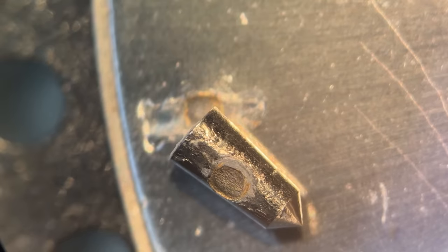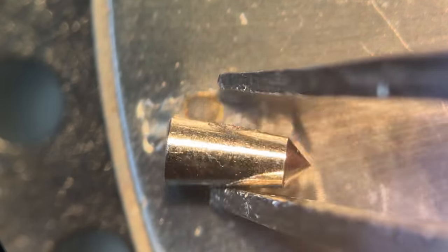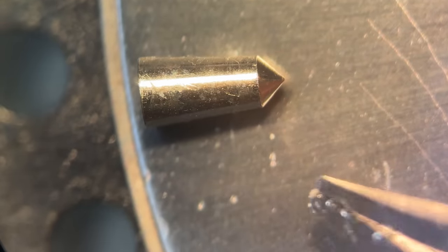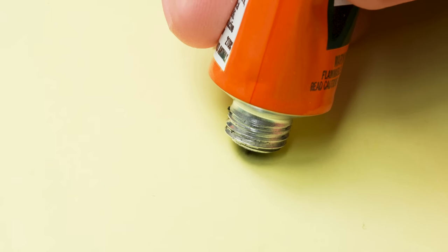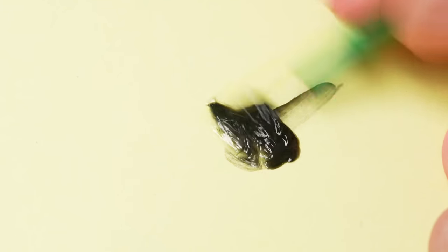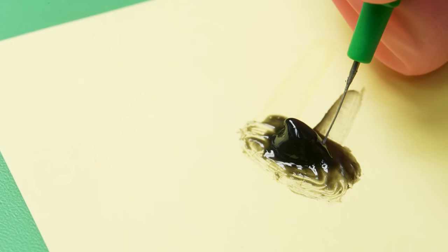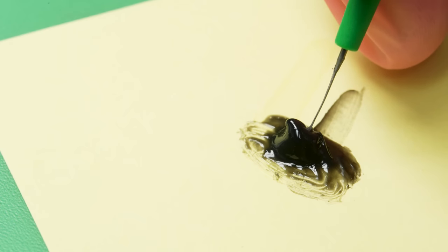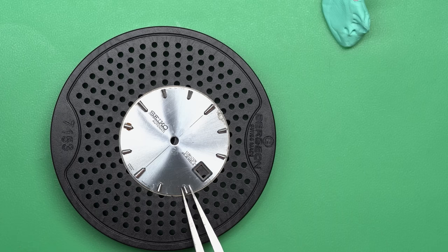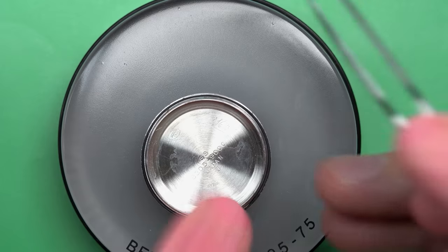On the microscope, you can see right where it was — it looks like it was tack welded or soldered into place. I'm not going to be able to do that because heating it up on the dial will probably melt, warp, or deform it. So I'm going to use epoxy — I can mix it up and use one of my oiling sticks to apply a very small amount. When it dries it's really, really hard and it should hold. I'll use quick epoxy, which cures in about ten minutes to something decent. My goal is to get the smallest amount I can and try to get this thing lined up. We'll let that dry — it actually looked pretty good.